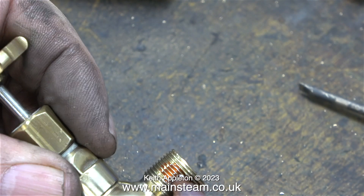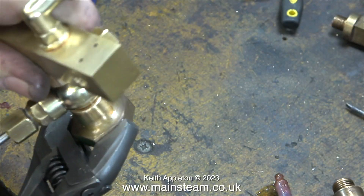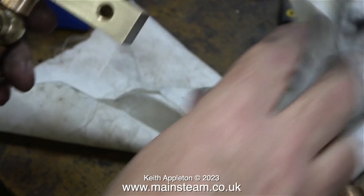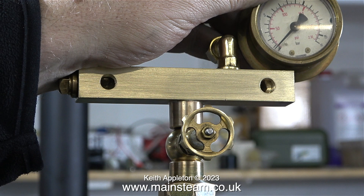When I was happy that I'd removed sufficient paint I applied some Loctite 542 — and no, I do not have a sponsorship deal with Loctite. I like to buy the things shown in the videos so I can be honest. I'm doing a test fit on the boiler itself, giving it a clean with a cloth, and here it is screwed partway into the boiler. The globe valve fits very well into the base fitting but I do need to shorten the thread so it goes further into the top part. Here's the old pressure gauge that I'm not going to use — I'm just holding it in position to give you some idea of what it's going to look like.